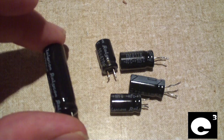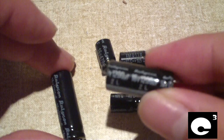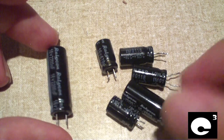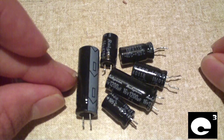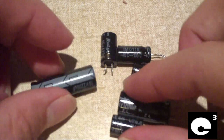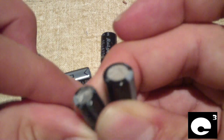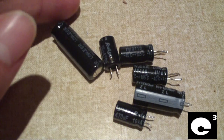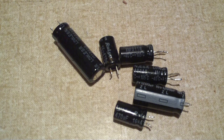So anyways, if you're ever sifting through some capacitors, watch out. Make sure it says Rubicon, not Rulicon. Put them all together and you wouldn't be able to tell the difference, would you? Notice the K-tops — they look almost alike. That's an example of a counterfeit capacitor. Any questions or comments, let me know.